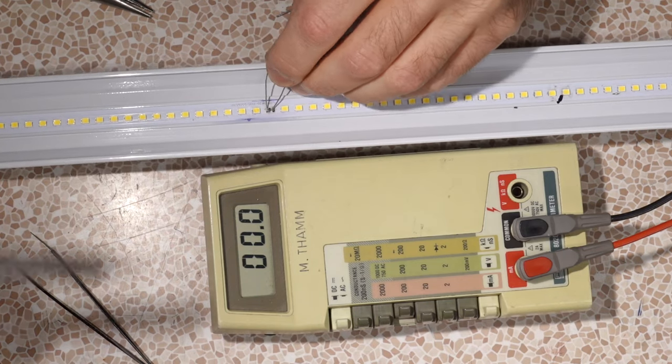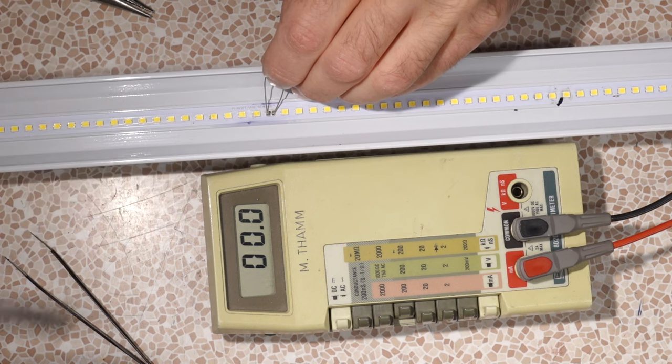So if we wanted to drop 2.89 volts divided by 0.075, we'll say 75 milliamps, that needs a 38 ohm resistor. Such a thing does not exist in my inventory. A 47 does exist though. So I've quick tacked on a 47 ohm resistor.